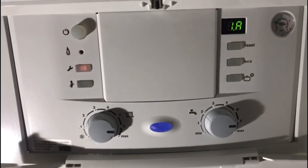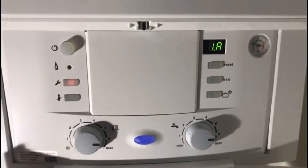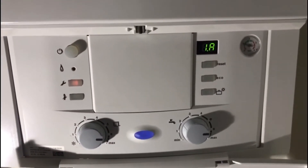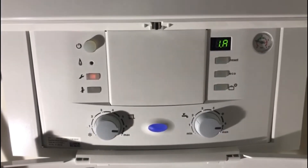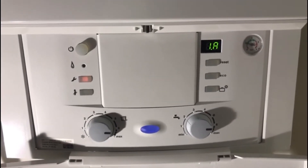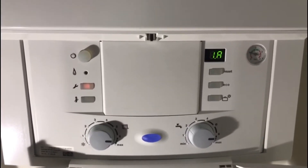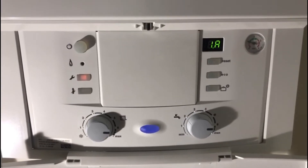The boiler won't go above 60% even if you turn the thermostat to maximum. Really useful if you want to put a CDI on a not-so-big system. It's one of the few modern boilers that you can range rate — you can do it on Aristons and many different boilers — some have the menu as installer-only or manufacturer-only, but it's a good menu to know about.